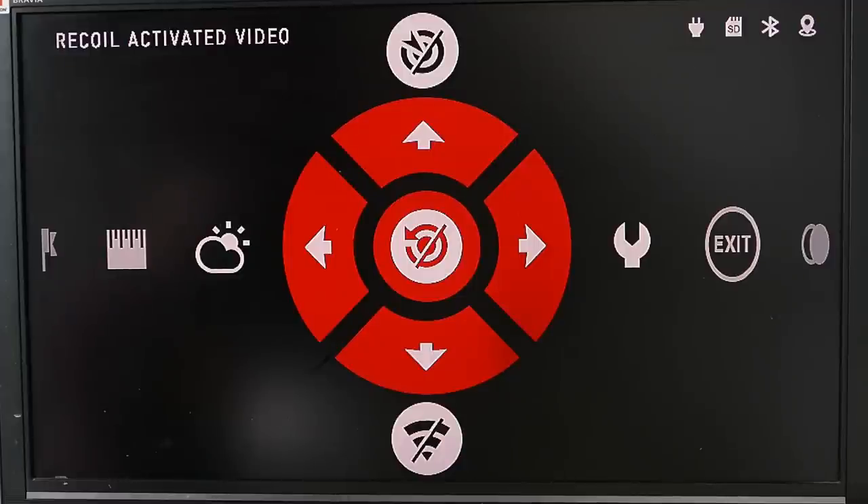I've run this over a voltmeter — the draw when you don't have GPS on and you don't have Wi-Fi on is about a third of an amp. That doubles if you turn GPS and Wi-Fi on. Drawing 0.6 of an amp at 5 volts from four AAs is why you have a problem. If you're running the power pack, this isn't a concern. But if you want to run light on lithium AAs, turn off Wi-Fi — the only reason you need Wi-Fi is to stream to a device, so turn it on when you want to stream and leave it off the rest of the time.